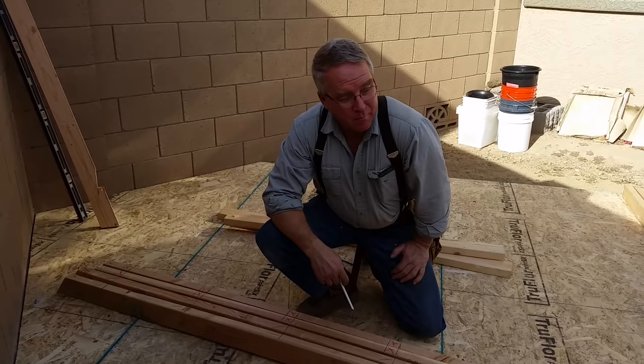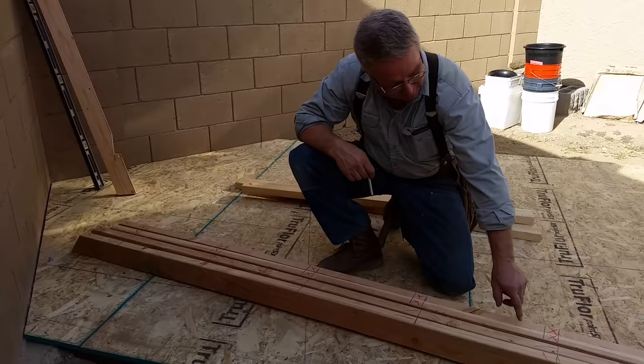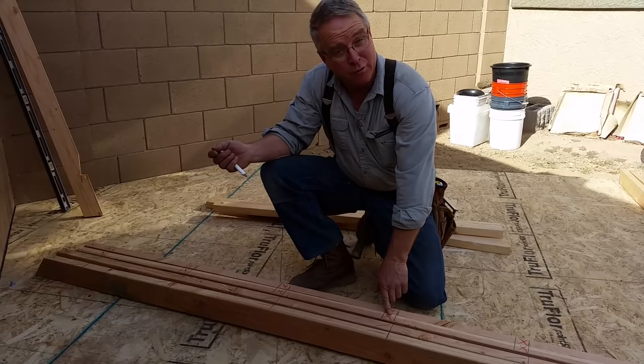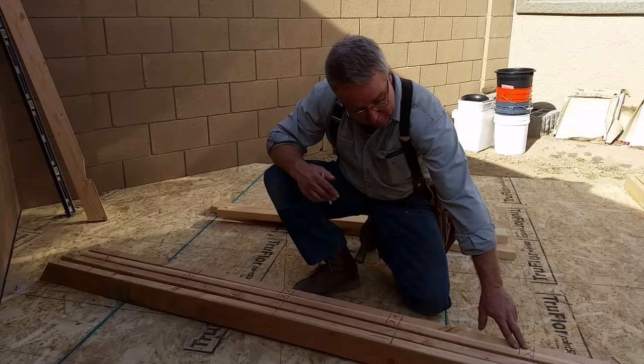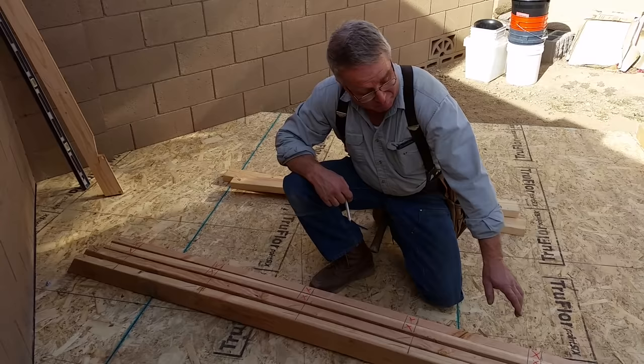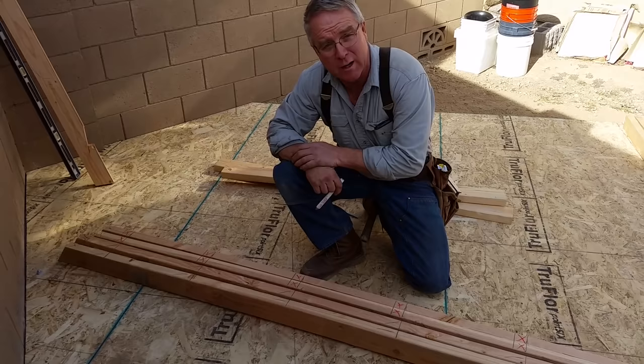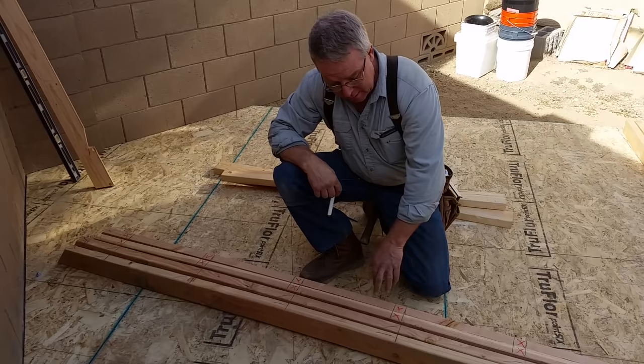The layout on these two sets of plates is intentionally two different examples. If you're detail-oriented and have lots of time, or someone else is coming behind you to assemble the wall and you're providing layout for another crew, then you want to detail it and make it hard for them to misconstrue the marks. If you're in a hurry and you're the guy who will follow your own layout, don't put any more time in it than you have to. We're trying to get the studs in the right place, not make pretty marks.